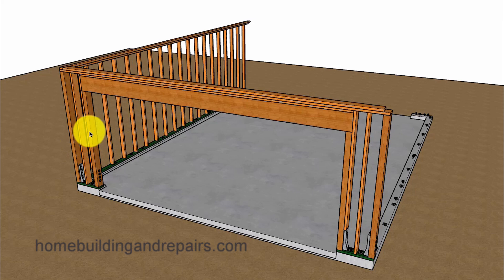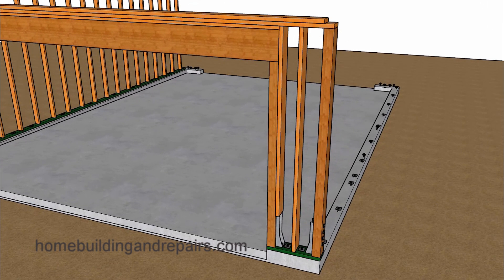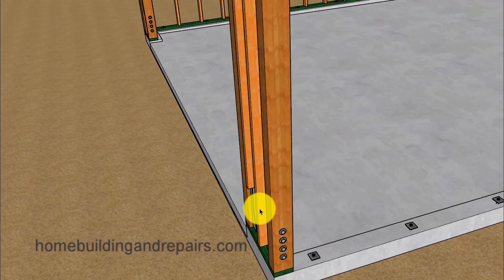However, this wall here is going to be a two-by-six wall so that we can put some four-by-six posts in to provide a little more structural strength, along with our heavy-duty hold downs. There's a good chance your engineer is going to want a three-by plate — something two and a half inches thick instead of an inch and a half thick. If that's the case, don't forget to adjust your framing studs, which might be as simple as cutting one inch off of them.